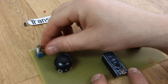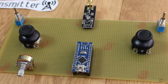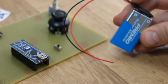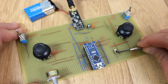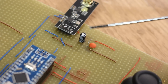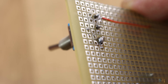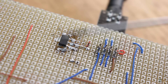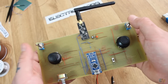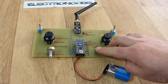Next add the 2 toggle switches, one on each side - those will be the 2 digital channels - and finally the extra potentiometer as an analog channel. To power on and off the board I've added a sliding switch. The battery connects to this switch so when we slide it, the entire board is supplied. Finally, solder the 3.3V voltage regulator with the coupling capacitors and make all connections as in the schematic. Those connections include supplying 5V and ground to the joysticks, switches, and potentiometer, and connecting 3.3V to the NRF24 module. Make the SPI connection by soldering the clock, MOSI, and MISO, plus chip select and chip enable. Remember to solder the wires from the battery to the sliding switch.